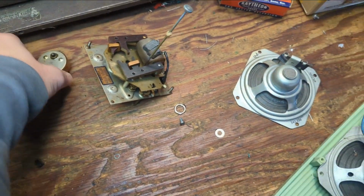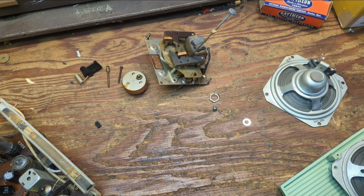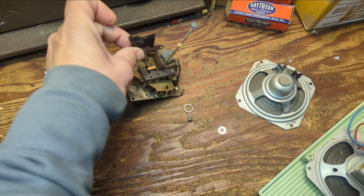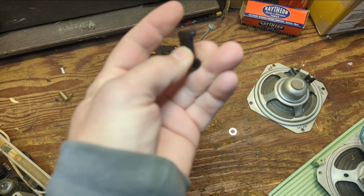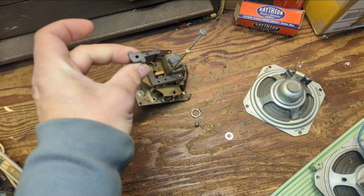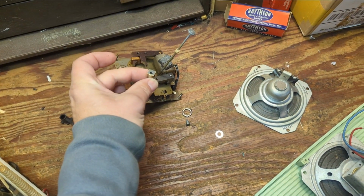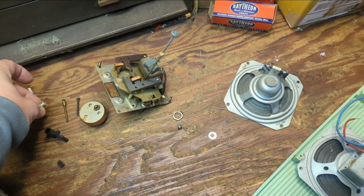Yesterday, as you saw, I lubricated the mechanism. That should run a lot more smoothly. This one's a little bit different. There is a plastic piece that goes on the left side. Has these little buttons, depressions that lock up into the plate here. You want to put it in there just like that, like so on this side. And then this little guy goes this way, and you want to make sure that this little finger tab touches down on the drum.